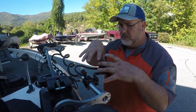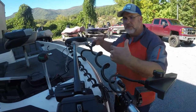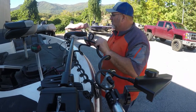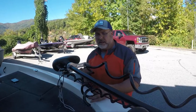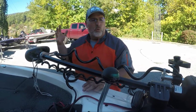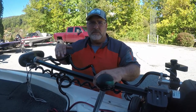After we mount this unit, we put the transducer on and attach the cable connector at the bottom, and it curls all the way up. This keeps it away from the shaft whether it's deployed into the water or pulled out running — no pinch points to grab the wire and cut it. We continue this curl loop all the way down. A lot of people stop the curl loop early, which causes the wire to bend. By continuing it down, as the motor fully deploys, the curl loop protects the main wire from being pinched in any one location.